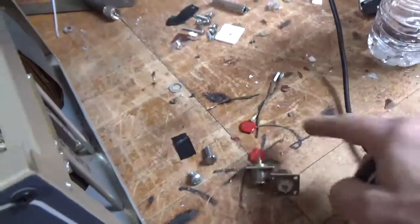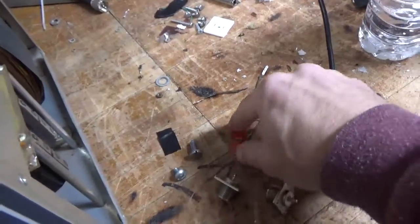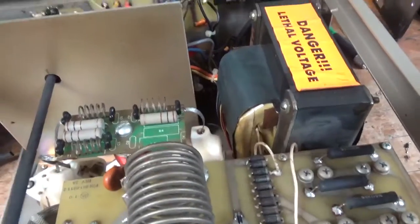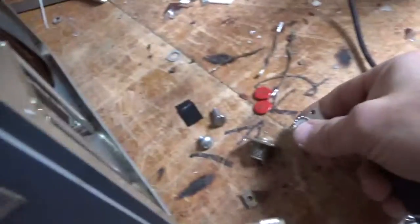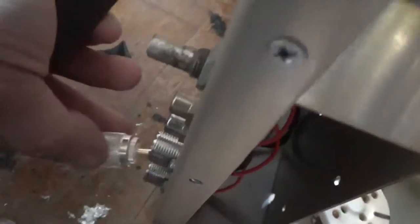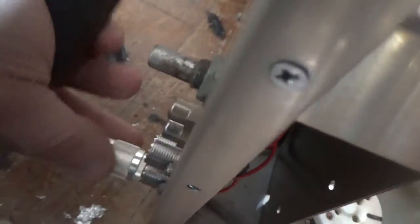The old straps were pretty frayed. Took out the metal oxide varistors — had to take the wall out and the shaft out to do that. Replaced the SO239 connectors; as you saw, they had no grip. Here are the new ones — nice and tight now. Also seeing a lot of times where the screws are loose, so I always tighten them up really tight with a screwdriver, then go inside with a quarter-inch wrench and snug them up real good. Added a gas discharge tube to the base of the socket.